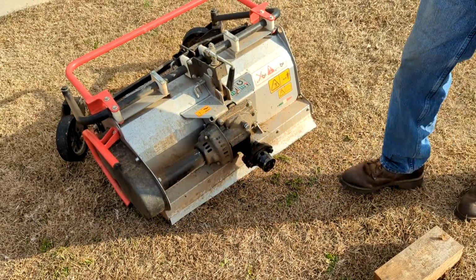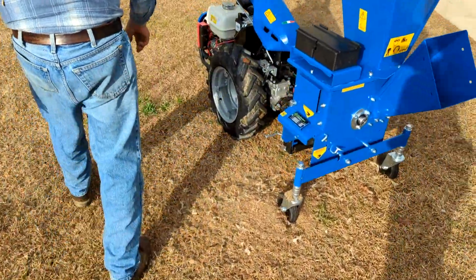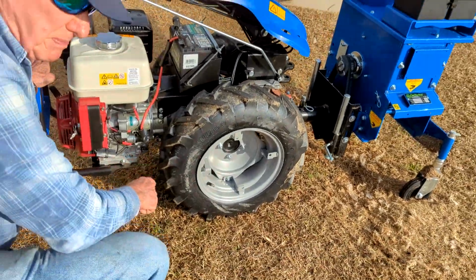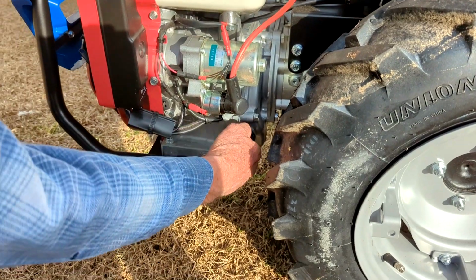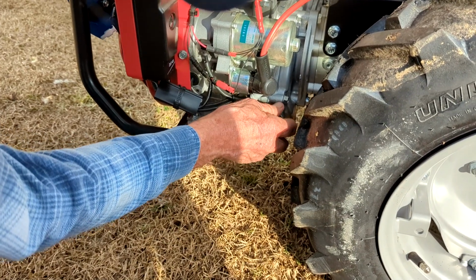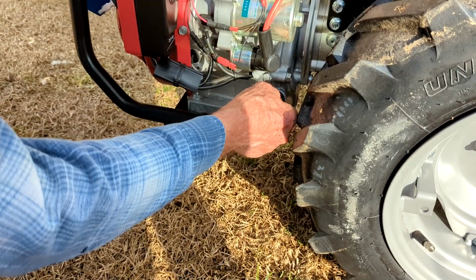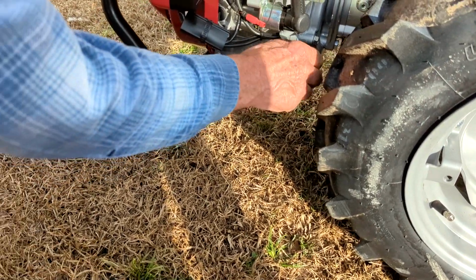Now I want to go over the tractor with you for just a minute on the oil level check. There's two oil level plugs for the engine, and they're both back here on each side. This black plug right here. Okay, it unscrews. And what you want to do is you want to take this and you want to hold it in against the threads. And then you want to take it out just a little bit, and hopefully, okay. Did you see oil drip out? Oh, yeah. If oil drips out, you've got it.